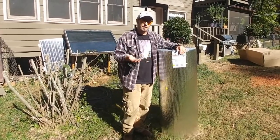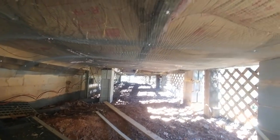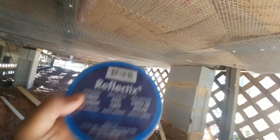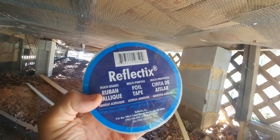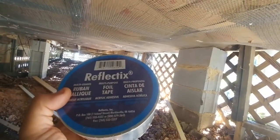Alright, so this is what we're looking at up underneath the room — this is Ethan's office where he has all his guitar stuff and his desk. You can see there's the foundation, and the deck is beyond those cinder blocks. We've got the insulation and the critter screen in there. The idea is we're going to put some furring strips up along the joist and then staple this bubble wrap insulation to that. We also have a roll of reflectix aluminum tape made for this purpose. There should only be one seam since it's about seven feet across and we have 48-inch material, so we'll overlap it a little in the middle and run a strip of tape down the seam.